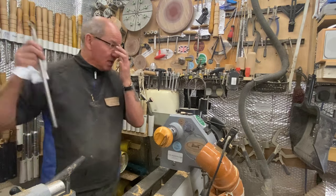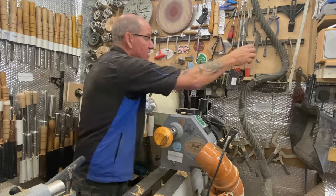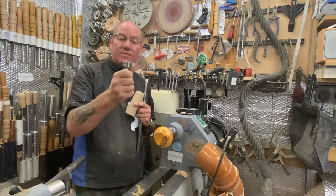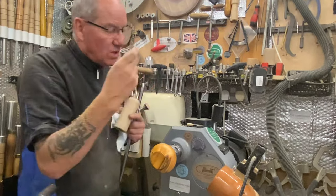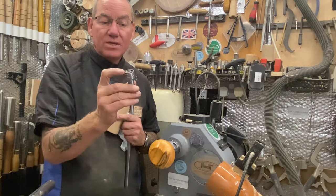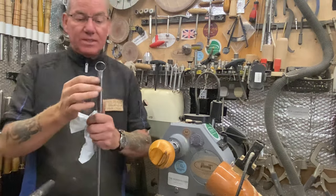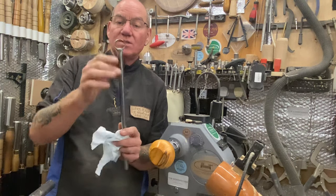That's actually a ball bearing, that circle there. I said before, I bought some of those crappy live centers, and it's these. They have two ball bearings on the end. When you take that cone bit off, I took them off one of the other ones I had, and then I used the ring from that. As you'll know, bearings are very hardened steel, and I welded it on the end of a 16 mil bar, sharpened it up, and it's like a razor and it works lovely.